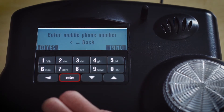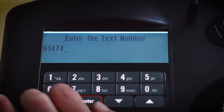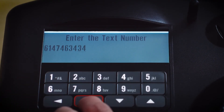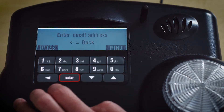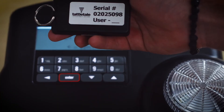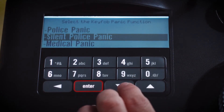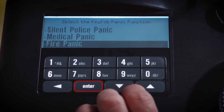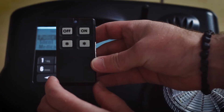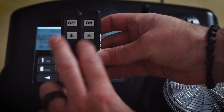Next, you'll be asked to enter your mobile phone number — the number you'll want to use to receive alarm notification texts. Press 1 for yes, enter your phone number, and press Enter. The next thing you'll be asked for is your email address; whether or not you choose to add it is up to you — it's simply a double redundancy feature of your Tattletale system. Now you'll program your keychain remote. Press 1 for yes, then enter the serial number on the remote. Then choose the kind of panic alarm option you want: police with siren, police silent, medical, fire, or panic disabled. When you need to send a panic distress signal, you do so by pressing and holding the two starred buttons on your keychain remote simultaneously.